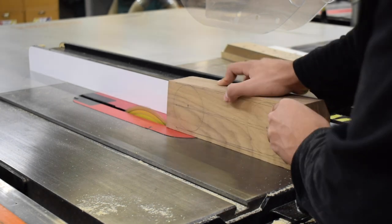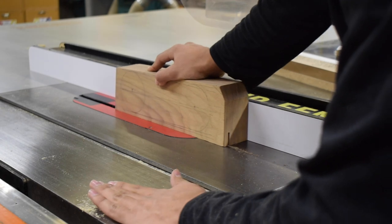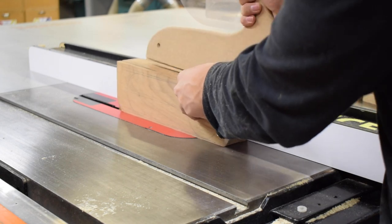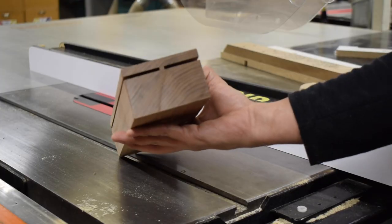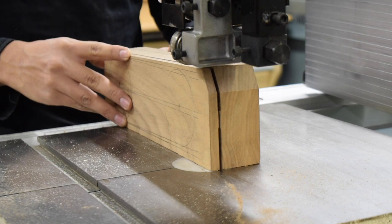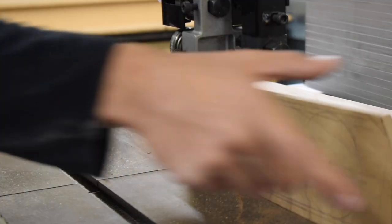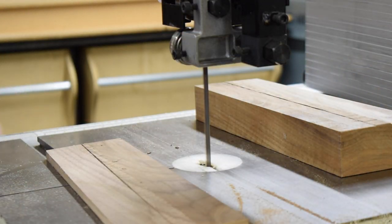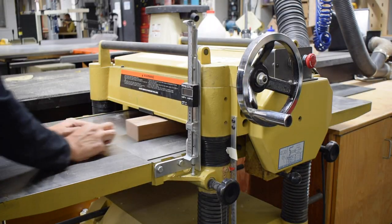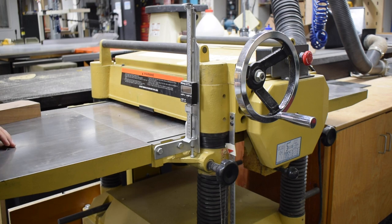In order for the speaker to fit inside of this wood chunk, I'm going to have to do a resaw because I don't have a forstner bit big enough for the initial face, but I do have a hole saw that works. So we're going to cut off the face, then use the hole saw, and eventually use a forstner bit to cut the inside. For a resaw, first you cut both edges with the table saw, then use the bandsaw in the middle. Once you use the bandsaw there's still some residue left, so we're simply going to use the planer to clean that up — and as you can see, it leaves us a nice clean face. Now we're going to do the same thing with the other piece.